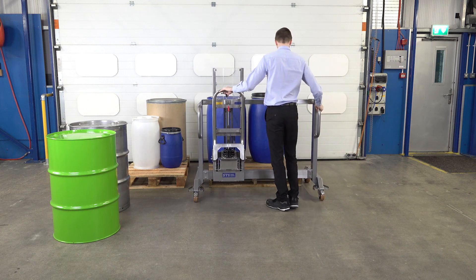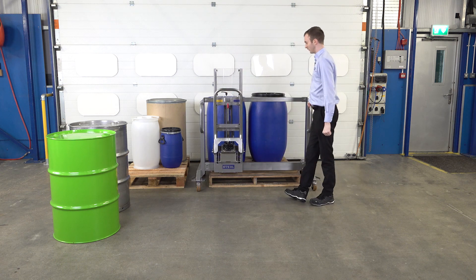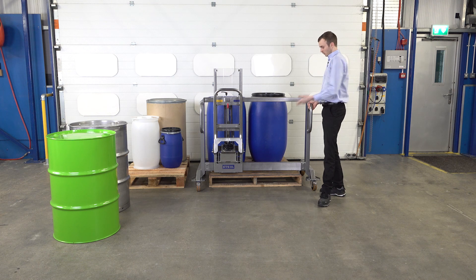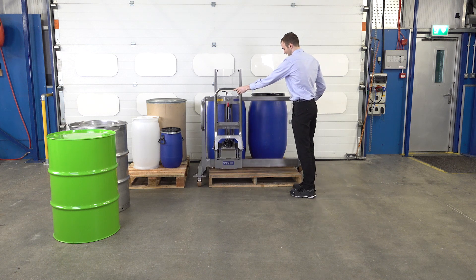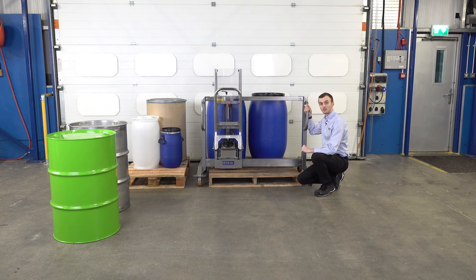Lining our wheels up and bringing the unit in. Now this is another unique part of this model — on a square 1200 by 1200 pallet, the whole lifter body straddles over the top of the pallet, so you can see under this cross beam we've got the pallet itself. This means from one side of the pallet we can take the front drums and then both drums at the back as well — a great way to optimize storage space, with one model unloading four drums all from the same approaching side.